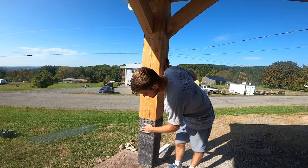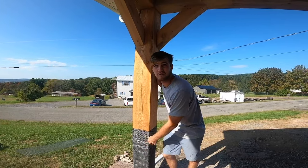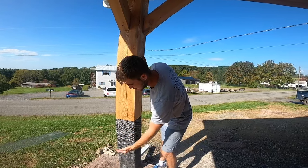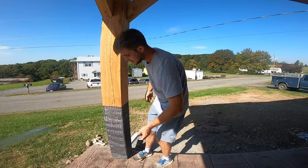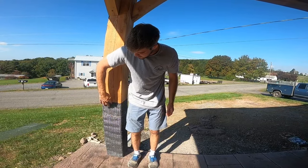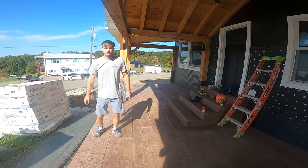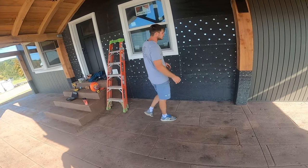With this one I used a nail gun - it was easy. I could put the nails right into it and I nailed the absolute crap out of it. You do not want to be skimpy at all with the nails; this is the only thing holding these things on there. We're only going 32 inches high. The wire is wrapped around, holding it tight - there's no way that wire is going to pull off. Anytime I have flat wood like this, I'm using a nail gun. I just evaluate what's going on with the wall.